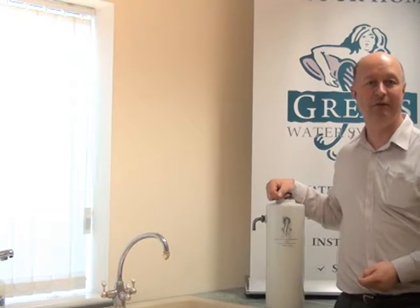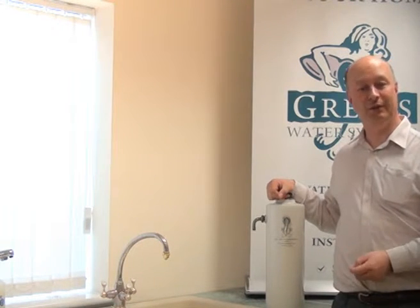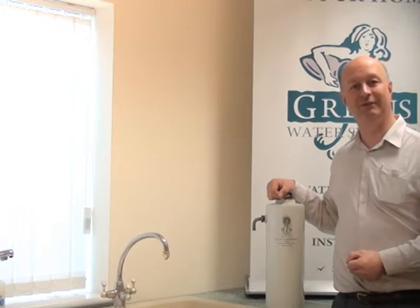Well, a glass of softened water, say an ordinary glass that's a quarter of a litre, 250 millilitres, if that softened water was made from ordinary hard water at 300 milligrams per litre, as much of the UK is, then the sodium level in that glass of water will be something like 35 milligrams. That would compare to drinking, say, a cup of tomato soup at over 1,000 milligrams. So I hope that clarifies the position, and will lead you to at least try drinking softened water to see how it compares for you with the alternatives.